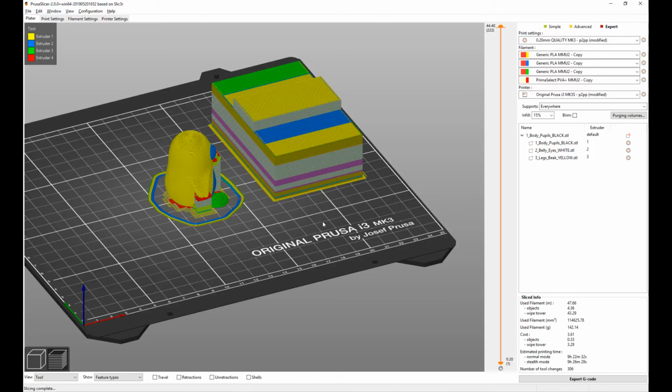In addition, the point of the buffer is to be able to print at higher speeds, and when I print at more extreme speeds, like past 200 millimeters per second, the variation in extrusion from the printer itself gets much bigger because the variation in back pressure from the nozzle is humongous when you're printing at those speeds. When it is actually doing 200 millimeters per second, it is like flooding plastic through the nozzle and has huge back pressure. And then you get into a corner and it has to slow down and the back pressure drops to almost zero, and then it speeds up again and you get a huge back pressure. So you have much more variation in extrusion, and thus you need much more feedback to the Palette to allow it to keep track of what the printer is actually doing.